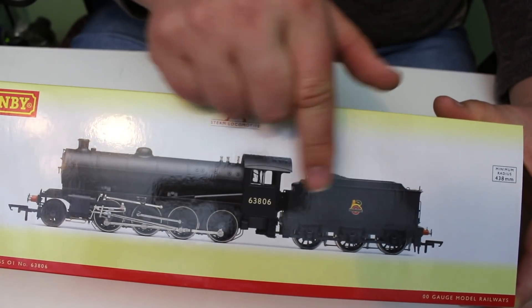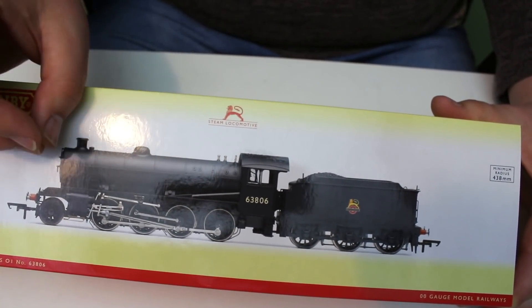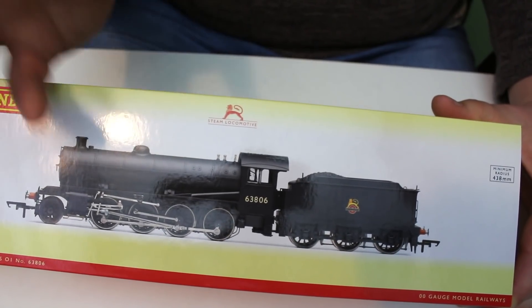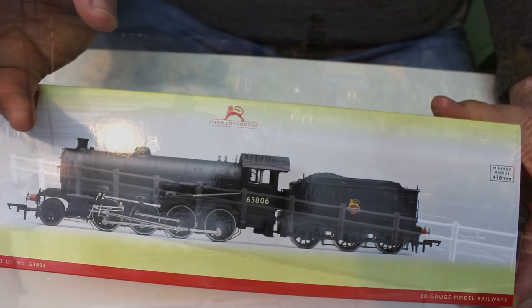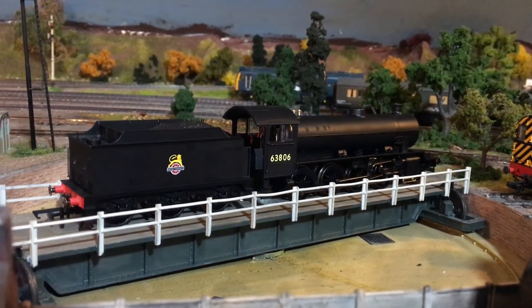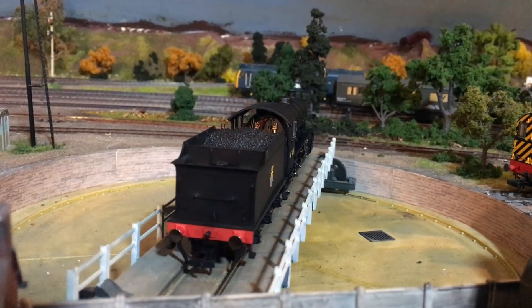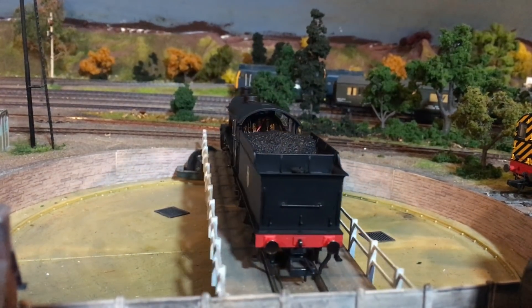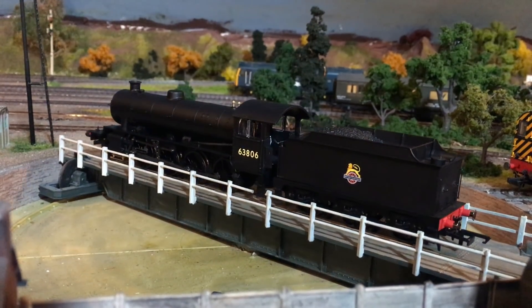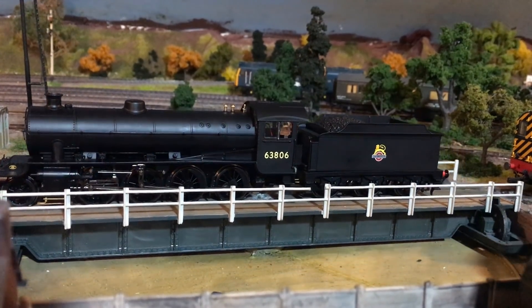These reused the tenders, the wheels, the frames and the front pony truck from the Robinson O4, but everything else was new — using boilers designed for the B1 class. They also had roomier cabs and a few other features including Walschaerts outside valve gear and completely new cylinders. The locomotives weren't converted en masse; instead they were assessed when they came in for works overhaul, principally those that had worn-out cylinders and were in need of new boilers.